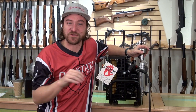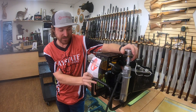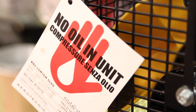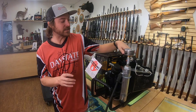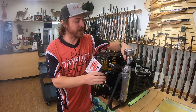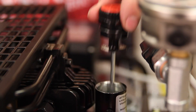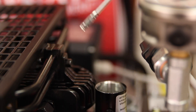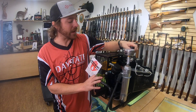So you've just taken delivery on your Daystate compressor, you pull it out of the box, and you're going to realize it has a big tag on it that says 'no oil in unit.' We do not ship these compressors with oil in them, so the first thing you have to do is put oil in. This big red cap that says 'oil' — it has an O-ring that seats it — just pull up on that and it's going to have your dipstick connected to the end.